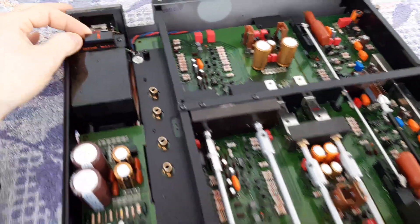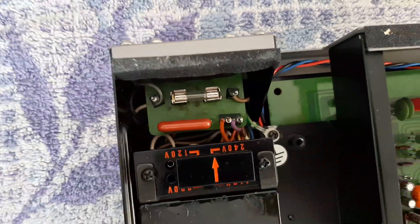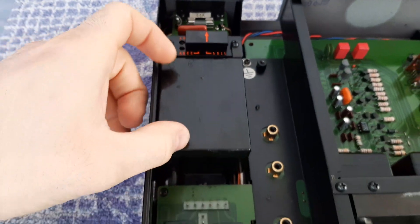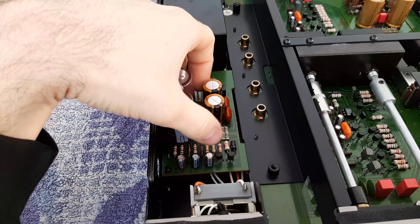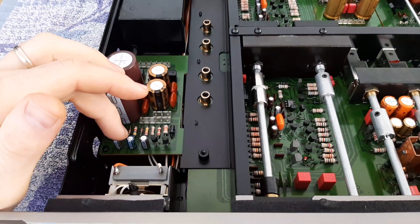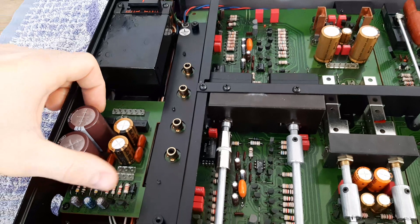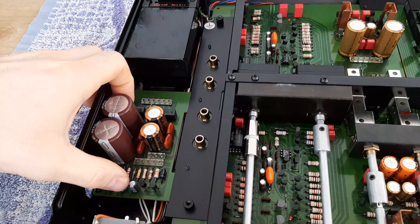Here is the main power transformer, and here is the voltage selector — it's a multi-voltage selector. It supports 110, 220, 120, and 240 volts. Here in Europe I should select 240. Here is the main fuse, it's 1A. This is the main power supply, and here is the mute stage, which energizes the muting relays — one here, second one here — the muting relays of the outlet from the preamplifier section. Here is the output relay, and the timing process is done by this section.